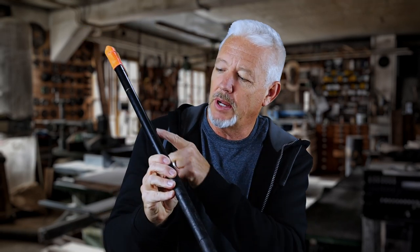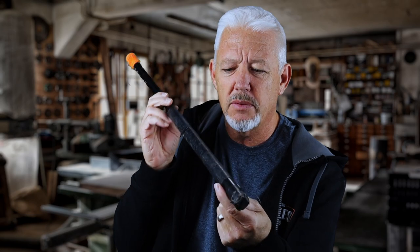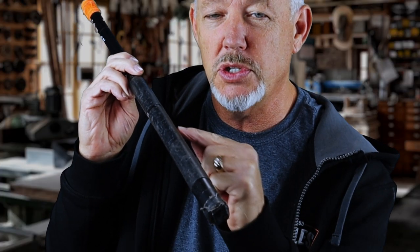The next tip is reinforcing this mast. When we put this thing on a rock pile, while that's a good thing to do to get this antenna mast up in the air, it's really tough on the carbon fiber, and you don't want to be chipping this thing and make it worse. So I found some 1 1/4 inch shrink tube to put on the outside of this thing. And now it takes the abuse instead of the mast. It may not show up in the camera here, but this is super beat up, super chewed up. The mast itself is in perfect condition.